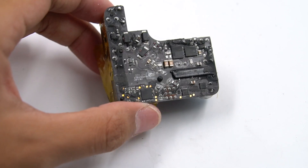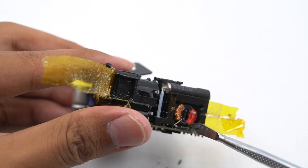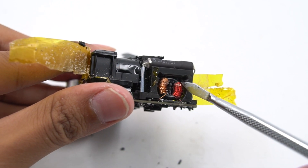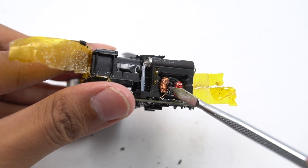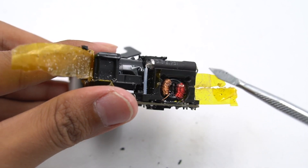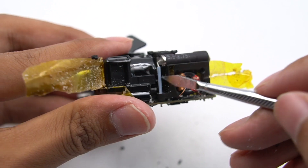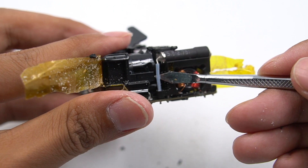The charger adopts a typical architecture which uses a switching power supply for wide range output and a secondary protocol chip to control output voltage. Let's analyze the components one by one. There is a plastic support frame at the input end. The common mode choke is placed in the hollowed part, used to filter EMI interference. The input fuse is on the top, covered with heat shrink tube, and the insulating tube is covered on the welding part.